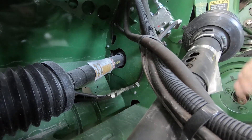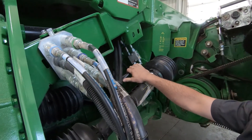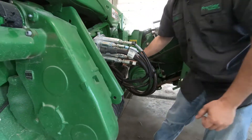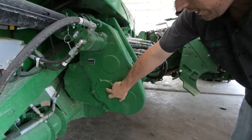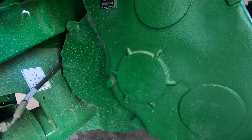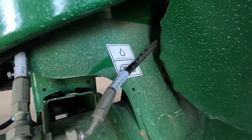Just when you're in this area, have a look at any of your lines and fittings — make sure there are no leaks, which could indicate a bad crimp or bad o-ring. Moving to your drive gear case for your draper, you want to make sure you check this with the header all the way on the ground. Here's your check port, and you can see the gear lube emblem there so you know what to put in it.